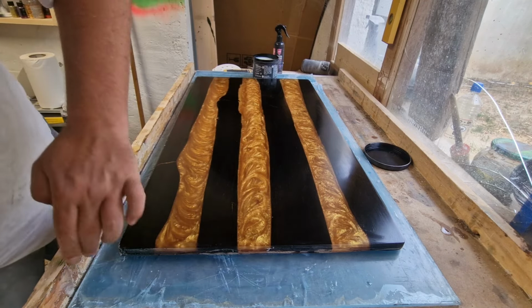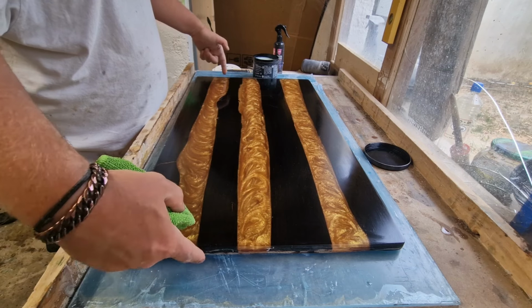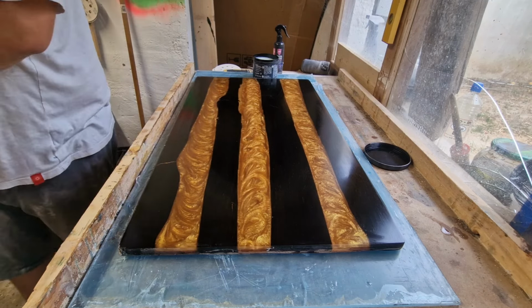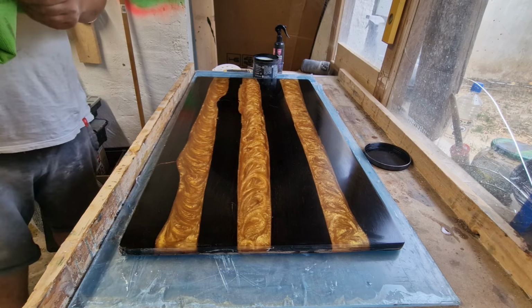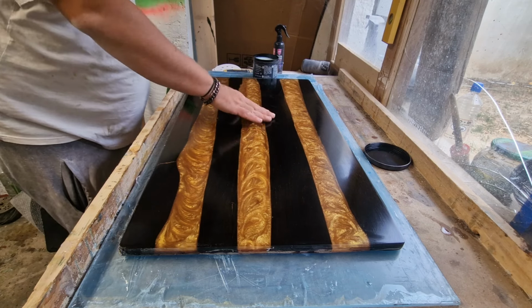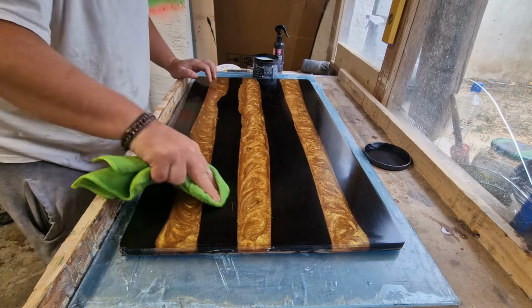Oh my god, I shouldn't have done that. I waxed the sides, but right now, because I waxed the sides, I can't apply any kind of finish to it, and I wanted to paint the edges. Anyway, disregard the edges today. We will deal with that later. So, next up, we should get a piece of cloth to shine this bastard up. Now, as I said, the problem with this wax is this guy never dries, so I am going to buff it as it is.